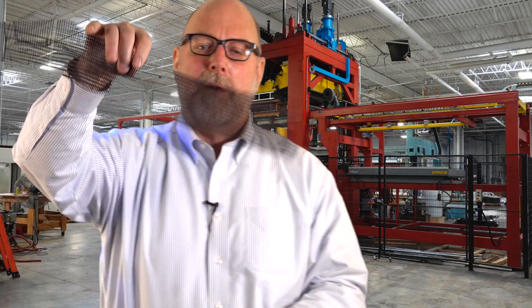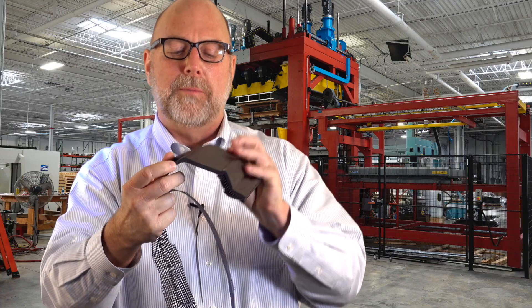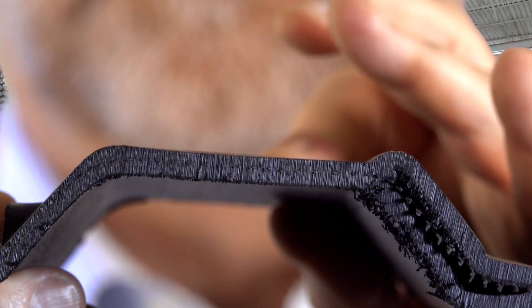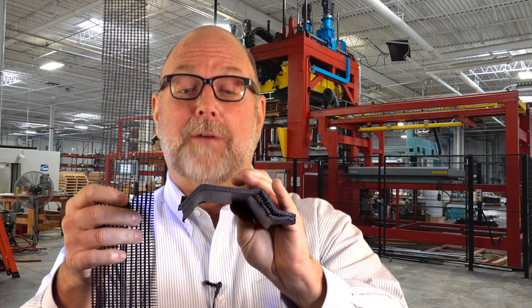Speaking of converting metal to plastic, are there any cool new materials coming down the pipe? We're trying to get into thermoplastics that are structural in integrity. We're going with a glass membrane that we can impregnate in a pressure formed part. This is a long fiberglass mesh embedded between two pressure formed parts — so we can take a thermoplastic, which isn't normally a structural or high modulus material, and make it a very high modulus structural component. This is still in the development stage, but it's a lot of fun to experiment with new materials.